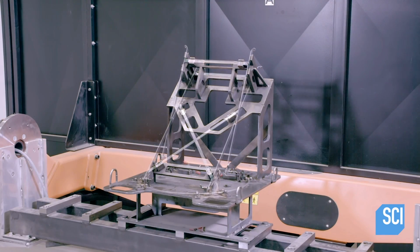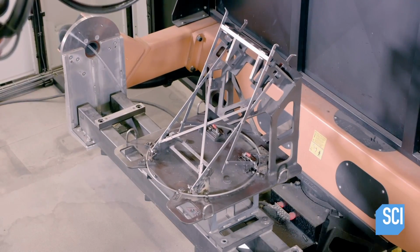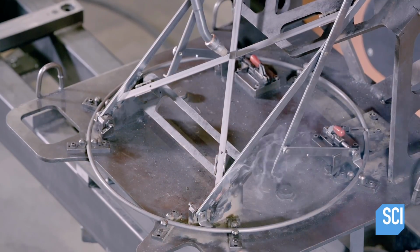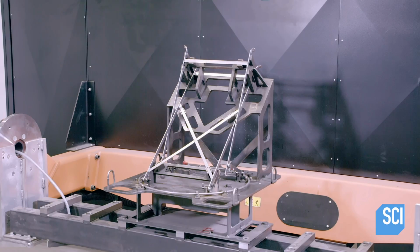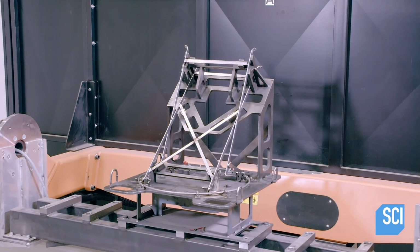After putting together the folding legs, a worker positions all the parts for the base on an assembly fixture. Then he operates a welding robot, which welds all the crossbars, reinforcing the legs and the legs to the ring. It only takes about 2 minutes to weld all these parts into a folding table base.